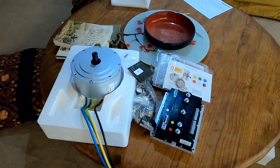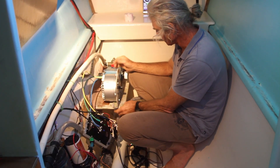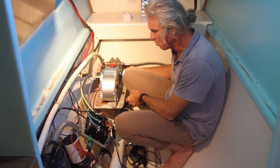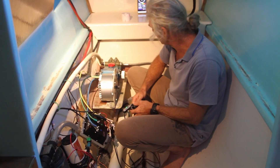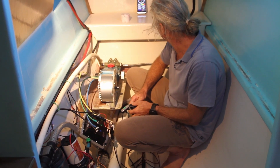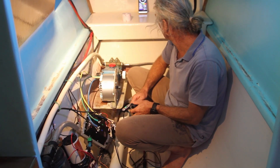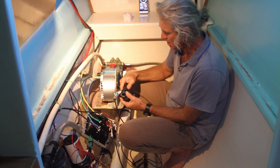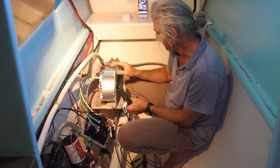I did make something of a mistake here, electing for the air-cooled model, when perhaps the water-cooled option would have been better. But it wasn't long before I was giving the motor a test run. So very excited here — the first test run of the golden motor, 3 kilowatt motor, which I'm going to be using to run my water maker pump. It's connected up to the app. That's about 1500 RPM. I am so excited about this little motor — what a beauty! You'll notice I'm using the bike style accelerator and switch. Somehow I'm going to modify this to set it to 1500 RPM.